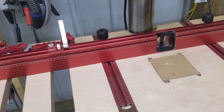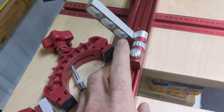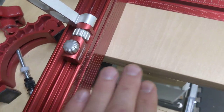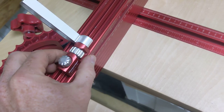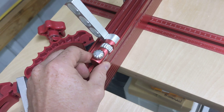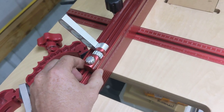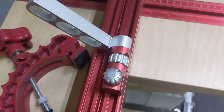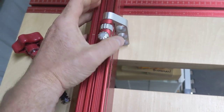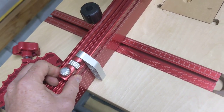As far as the Woodpecker hardware goes, something I really, intensely don't like is this design. The knurled knob on this flip stop right here protrudes just slightly forward of the fence itself, so if you put any stock against this fence that's taller than the point where this knob is, you're going to collide with that knob and not be able to get a straight bore. I think it's a really poor design on Woodpecker's part, especially considering the cost of these flip stops. It's a known issue — other people have complained about it — and they haven't redesigned it, which seems like a very simple fix.